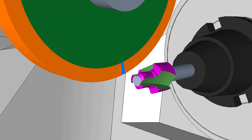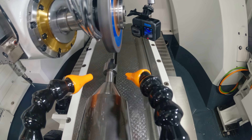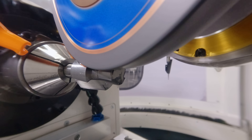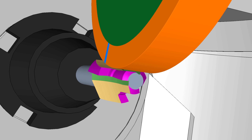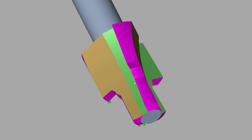The fluting operation is broken down into two different operations. The first is my initial flutes with the phase angle at zero degrees — I'll do four equal passes of about a hundred thousandths each pass at four inches per minute. I could take it all in one pass but I'd have to slow the wheel down to one inch per minute; four equal passes at four inches per minute gives about the same cycle time and is better for the RC wheel. The second operation uses a phase angle of negative 25 degrees, creating a flute in two different spots while following the same path.